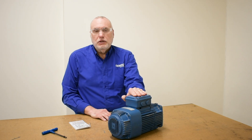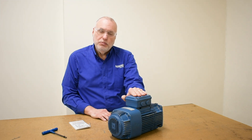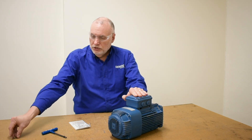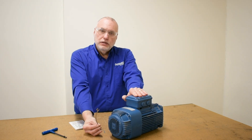But I do want to take time in this video to show you what to do in case you read a value of 3.0 millimeters — to actually reduce it back to 1.5, to the minimum. Now, these motors have a shim adjustment. To get to the shims, we have to remove the fan cover.